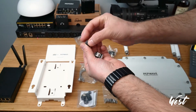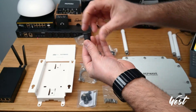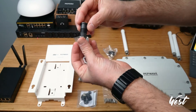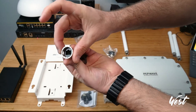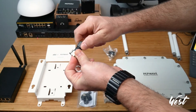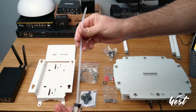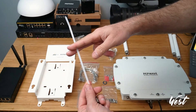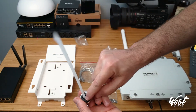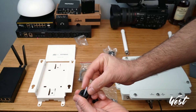Take the rubber end and put it on the bottom. Take the silver piece and put it through so the threads are facing outward. Then this connector goes in on the bottom like this. Then you're going to take your Ethernet cable through this assembly, and then you would crimp your cable. It's going to hook in right here, so you would slide the cable down and hook it in — it's going to stick in the bottom there.